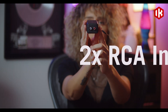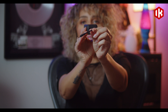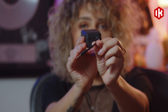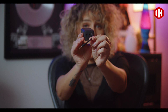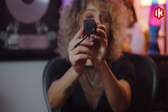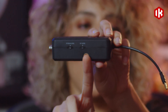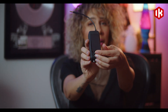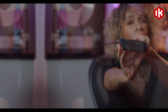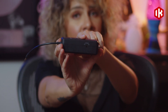Now let's talk about what makes this little piece of hardware so great. The iRig Stream Solo is super easy to use and you don't need special skills to get started. It has two RCA inputs, a headphone out with integrated mic input, one built-in TRRS cable that connects directly to your device — which runs audio into social media platforms through your phone — and another eighth inch mono output to send audio signal to another device. It's clearly labeled, and you can set your stream level independent of your headphone monitoring level, which is really helpful. It's also battery powered, which is great for producing content on the go.